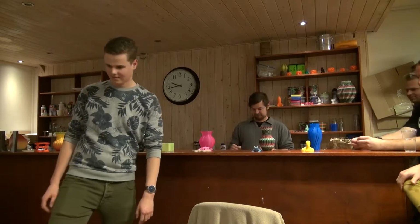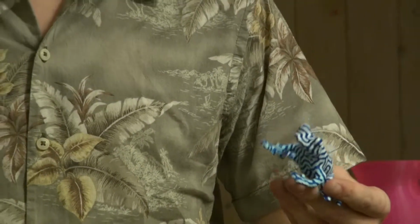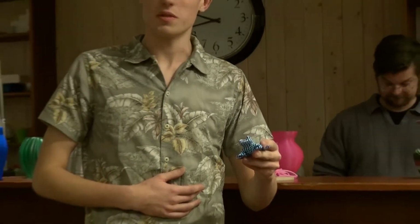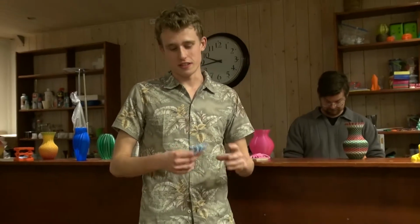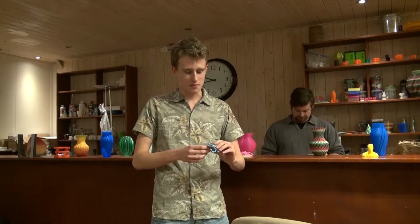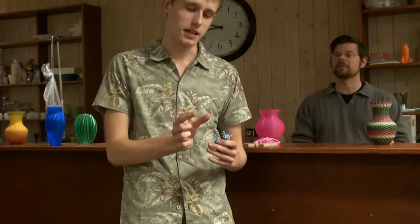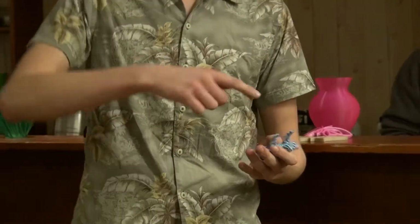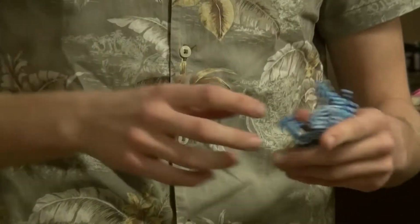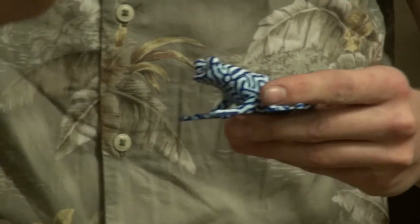Okay. Model number 2. Well, it's a 2-color print. It's sliced in Cura and printed with a diamond hot end. But actually, none of the slicers has support for the diamond hot end. So I made a custom prime tower, which is built up of little slices. Because when you make a square, it will just make infill into it, and you lose some volume on the prime tower. So that's why I made different slices.